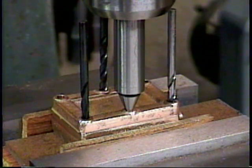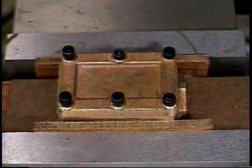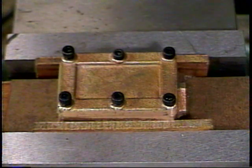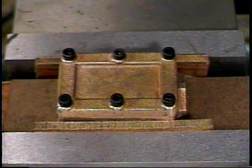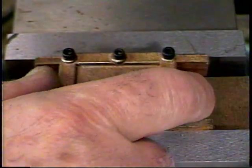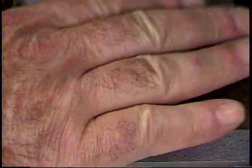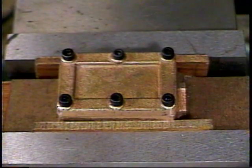And I'll always use all 3 number 29 drills to pin the part in place before using the conical edge finder to locate the position for the next mounting hole. And here we have a better look at the mated parts. And I've dropped some screws into the holes to show that the mating is good and that part is free, it doesn't bind up. We've located our mounting holes in the right place to mate the 2 parts.